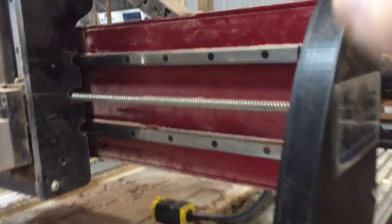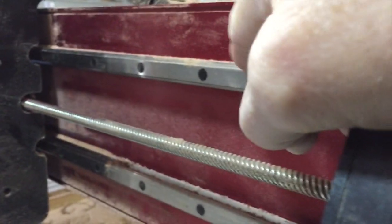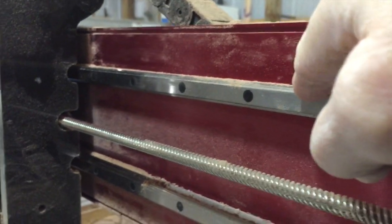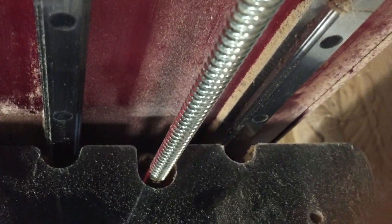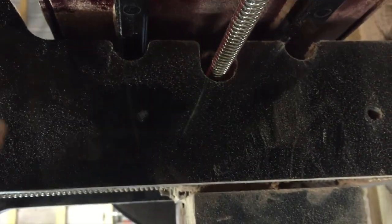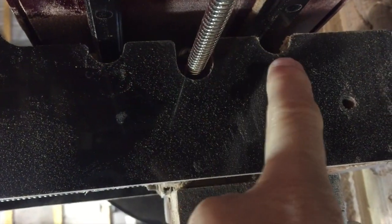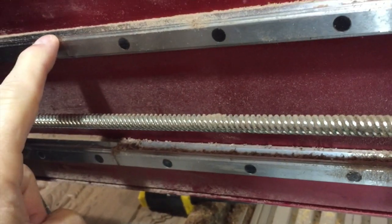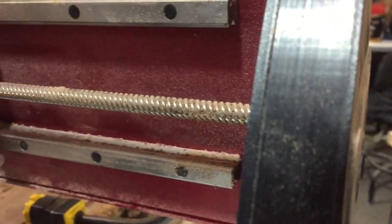The HD5 has a new rail bearing system that's quite different. If you do not clean, wipe, and lubricate these bearings every 30 hours, they will seize up — and if they seize up, it's not an easy job to get to them. There are two bearings visible through this slot, two more here, and two more on this thread that must all be lubricated every 30 hours or they will lock up.